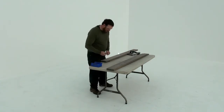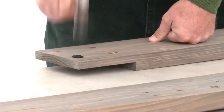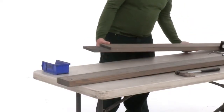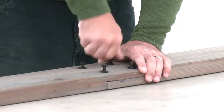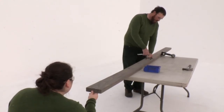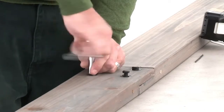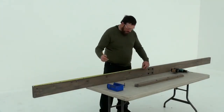Working on a flat, solid and raised surface, insert T-nuts into the four holes on one end of a front beam. Flip it over and place a second front beam on top so that the cutouts interlock. Attach loosely with four hex bolts. Have a second person check the alignment of the boards from one end. When the boards are straight, tighten the bolts. Next, measure 52 inches from one end of the assembly and make a mark.